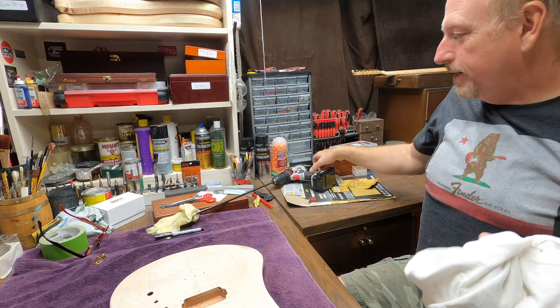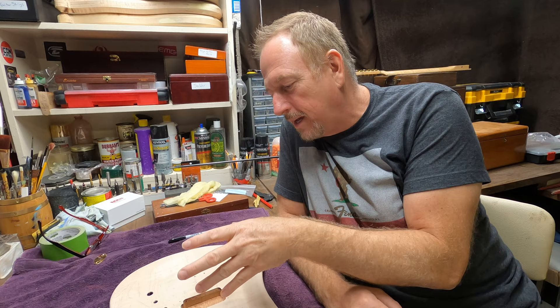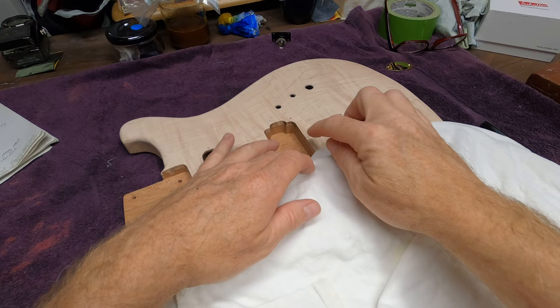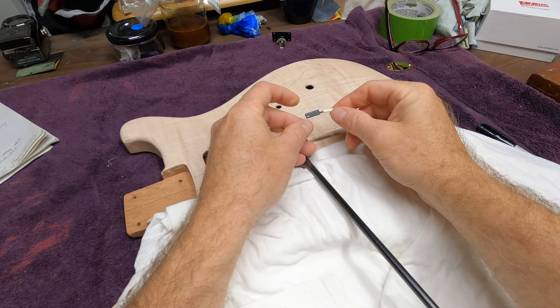Before I answer the question about the best and favorite guitar player, we're going to drill these couple of holes. What I want to show you is what bit I use and how I drill these holes for my lines to go from the pickups to the electronics cavity — where I'm going to have my volume and tone pot and my three-way switch. I use a very long drill bit, probably about a 16-inch bit, so my angle can be almost flat. This is a 3/8 inch bit.